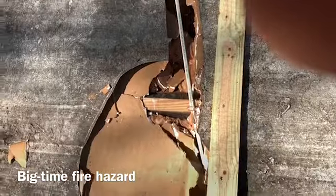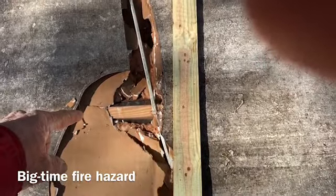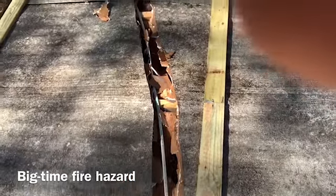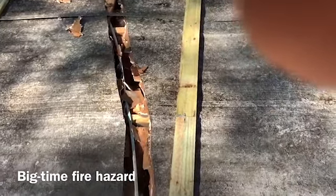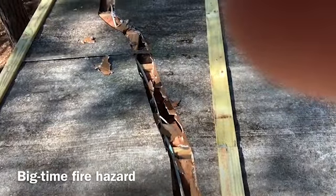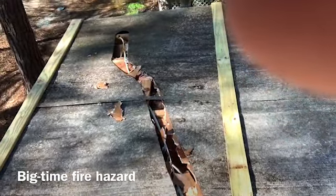Some of them, we'd put our plywood right down to the rafters, which on this house are pretty thick and big — good size rafters, two-by-fours, full size, real solid. But they ran strapping on top to lay their wires on top of the rafters and then ran metal over the top of it, which is insane.